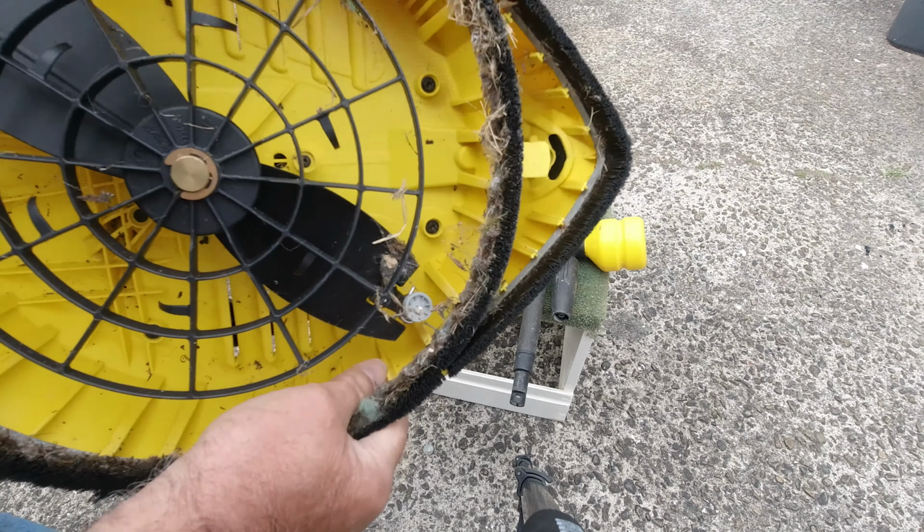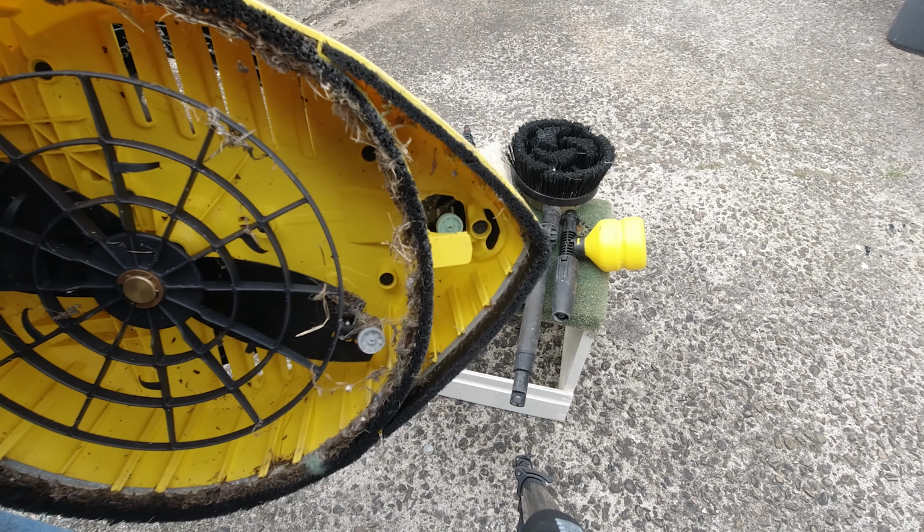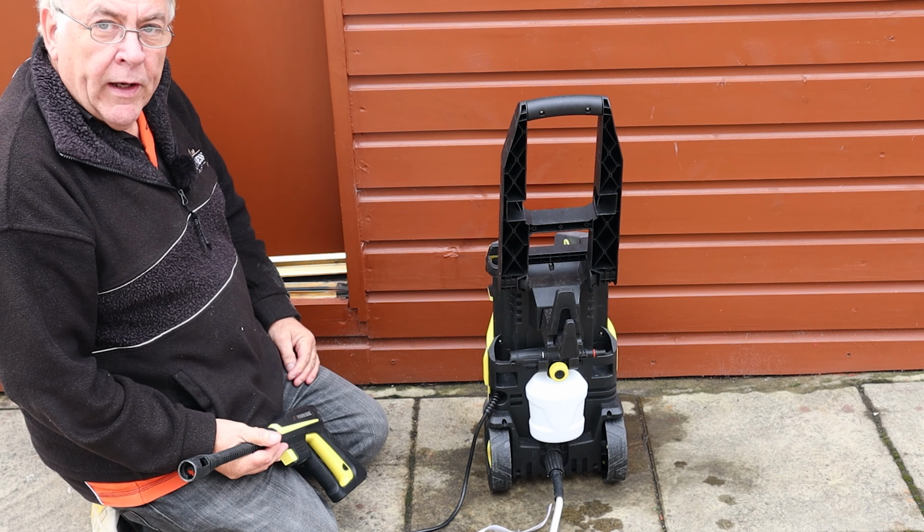And the good thing about this Karcher one is there's an extra nozzle here at the tip, and you can see it's for a corner, so you can get right in corners. You can adjust the power here from minimum to maximum on how much water is flowing through them jets, and with these two triggers here, you press that with your foot for the normal rotary one, and then when you press that one in, it transfers all the high pressure water to the tip there for getting right in the corners that a round one couldn't get in. So it's a pretty good patio cleaner, that. Right, let's see some of these in action now.